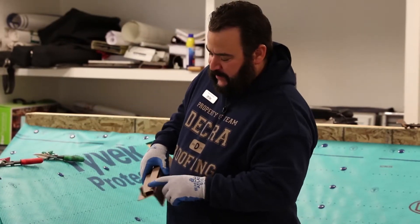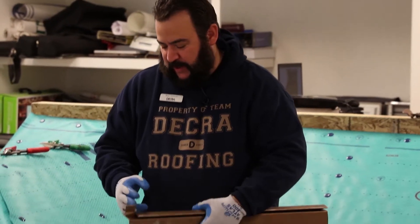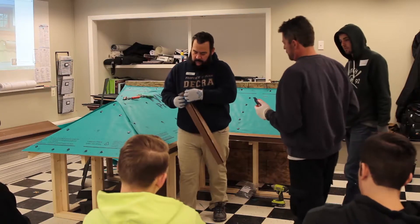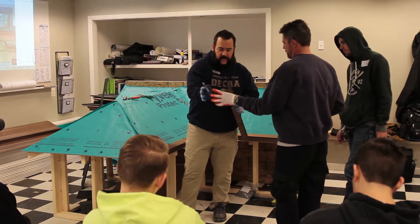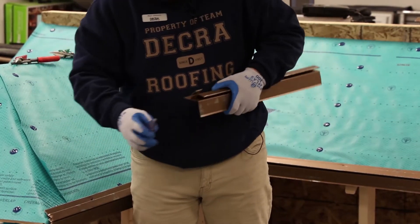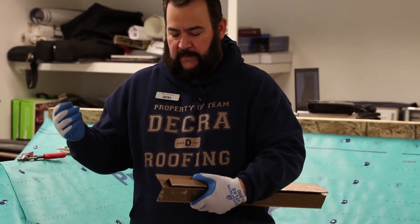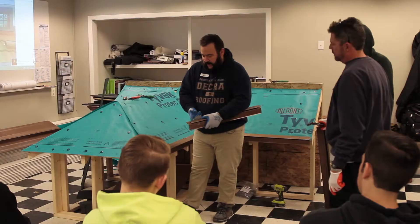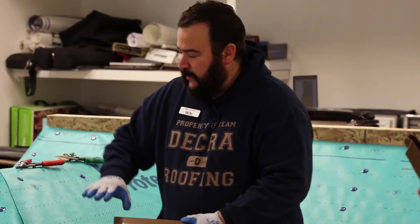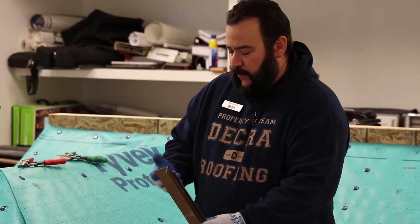One thing I'll do if I want to get rid of this lock — like if we're running a long stretch and we want to overlap these two drip edges — I'll snip it up and down the back side. Then with a utility knife, I'll just put a couple scores right through here and it'll just pop right off. So now you've got a nice smooth edge. If you tried cutting across this little seam with your snips, it would make a real jagged ugly edge that you can get cut on. It's also not going to let your piece lay real flat, so you'd have to come back and beat it flat with a hammer. The utility knife works really well for me.